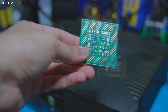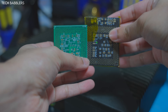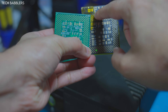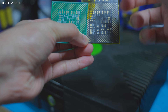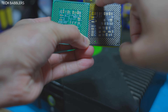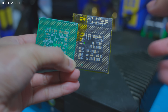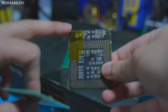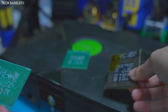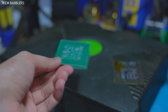He also released a no-speed version, which — as you see — the difference is this part is chopped off. That part is the speed reduction, so if you were to have those populated, it would go back to stock: 733 MHz versus 1.4 GHz. Most of the time we don't populate those because there's no real purpose. This is just if you didn't want the speed increase.